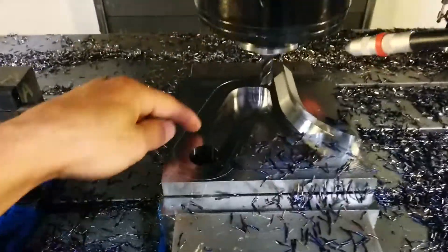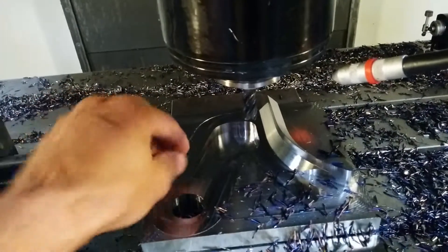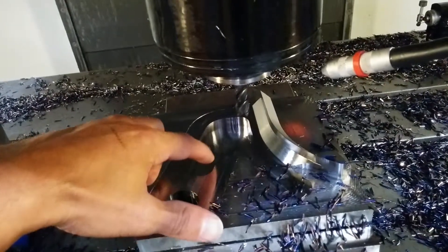Just to add some more information — you can see when the back radius portion was done in here, it's a decent way deep. What I had to do for the arc on the backwards pass is set it to be a little bit larger; I believe it's at a 0.4 radius. It also does a 5 thousandths micro lift on the back end of it.